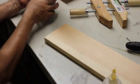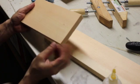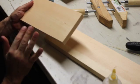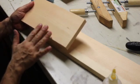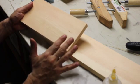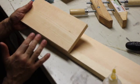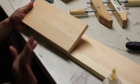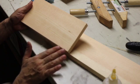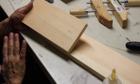One thing you can also do, if the wood has a surface and it's really smooth, it might not absorb the adhesive as well. So what you can do is give it a tooth, and what that means is you get sandpaper and you just rough up the surface. That's a really good idea if you're gluing plastic to other plastic things. And you wouldn't use wood glue, but you might use epoxy. If it has a smooth finish, really on whatever material, you want to get sandpaper and rough it up.